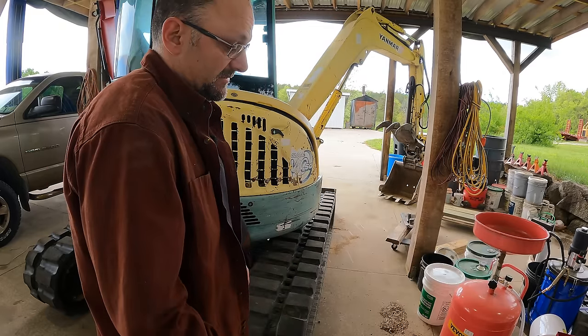All right, I've got a straight section of driveway. Here's my starting point, and I've got 110 yards I'm gonna go. I'm gonna see how straight it'll go, stay as straight as I can. Doing top speed here, hang on to your hats. So you saw how many times I had to redirect there. That was only in 110 yards. That came out to about just under 2.5 miles per hour, and it's supposed to go 2.9. Now with all the stopping and redirecting, I don't know. I mean, the travel motors might be getting all the flow that they need.